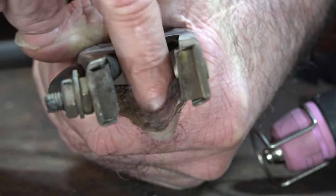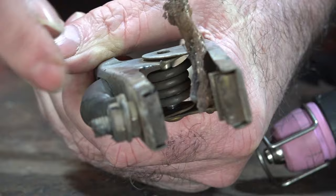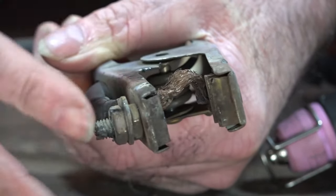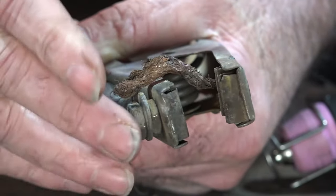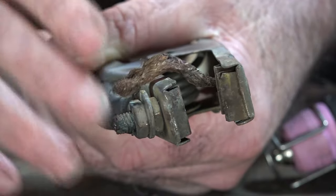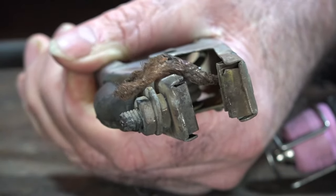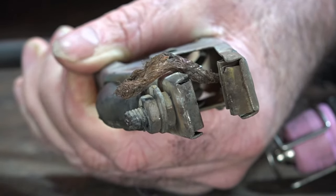Can you see that in here guys? This wire in here is broken. That wire is supposed to loop right around and connect to the other side of this jaw here, which gives us a proper circuit, but I've been using it with only half connected. It still works okay, but we're not going to get as much power as we would if that were connected all the way through. So that's the first thing I'd look out for — just watch out for your earth leads because they are really, really important.